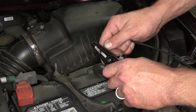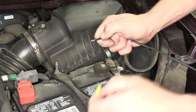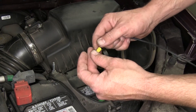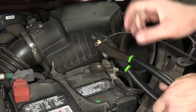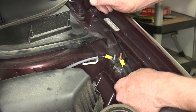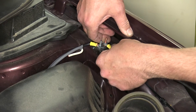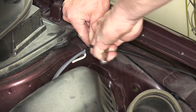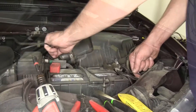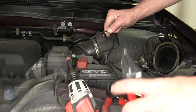Now we'll go ahead and take the remaining black wire from our gray duplex cable, strip back one end, and add a small ring terminal. We'll take the ring terminal, add it to the copper side of our breaker, where we'll secure it with the star washer and nut, tightening down both nuts to secure the ring terminals. We'll then route the wire over to the battery and ultimately to the positive battery terminal.